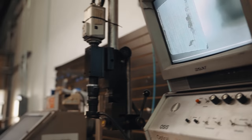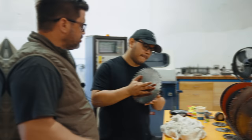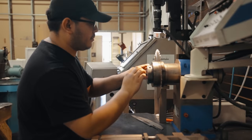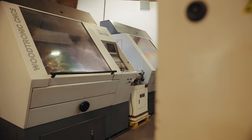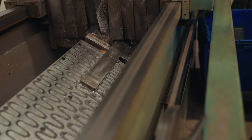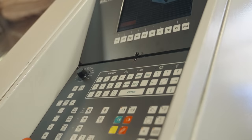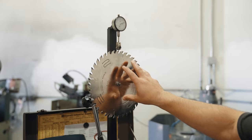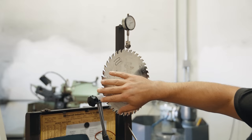That would be tough to see on your own — and that's one of the benefits of coming down to see Mike. Then it goes over to Juan who does a visual inspection, kind of the same things we did on the microscope, but what we're looking for is which machine we're going to use and the best angle of attack — pun intended — and how we're going to sharpen this blade. We also check the ATB and check for high-low, making sure that if there's a difference in the teeth, we can correct that when grinding.